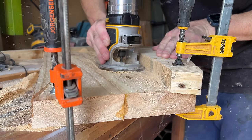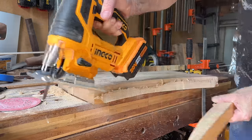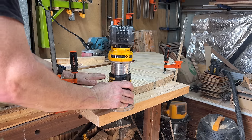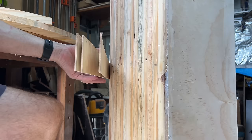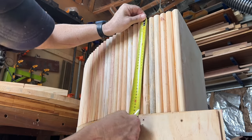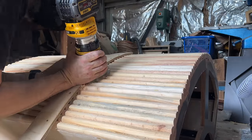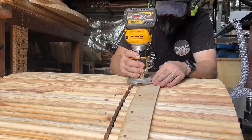I did get a little carried away on the second cut of this shelf. However, I caught my mistake after only one pass, luckily, and then I had to rig up the actual countertop so I could get the opposing arc for the other side of the shelf. So without much fuss, I had that shelf. I then had to rig up an edge for the router and the flush trim bit to run up against to cut out the recess for the shelf. Although it looks a little off-road, it wasn't. Slow and steady was the secret, and it actually worked out perfectly. Happy days.